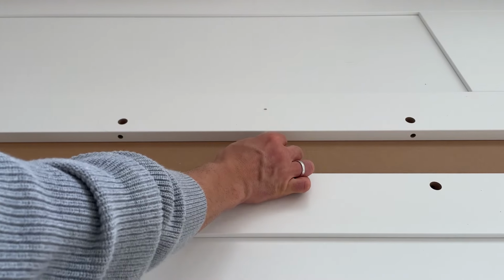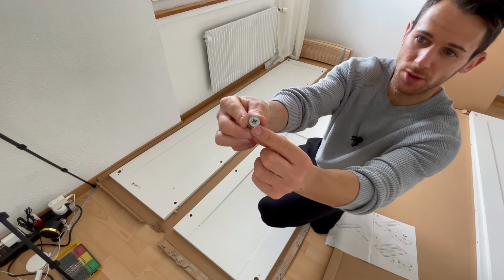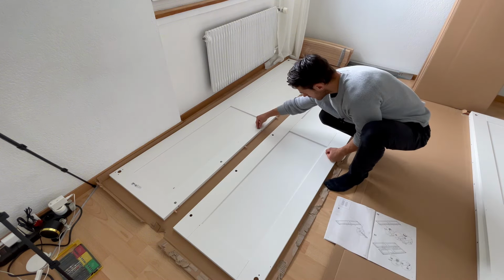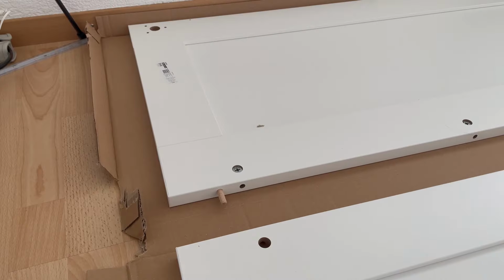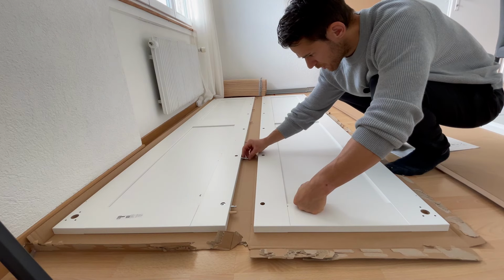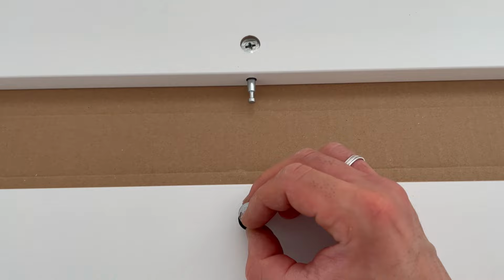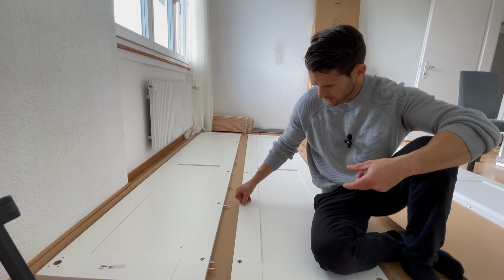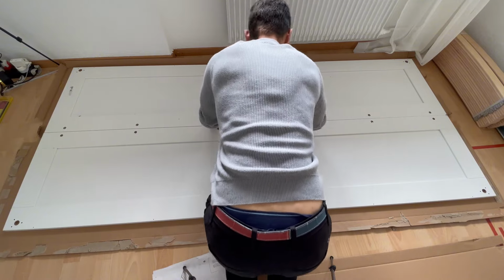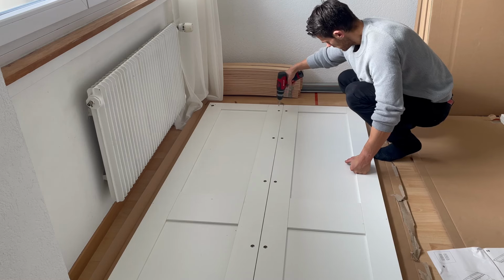And then you just have to connect the doors. In my case, I have 1 meter door, and for that we have some wood connections with some metal connections put all together like you're seeing in this video. Just screw them in place, connect both doors, and you've just made your first door with 1 meter. Each side has 50 centimeters and both together makes one door with 1 meter. So you have to do these twice, and after that you have 2 doors.